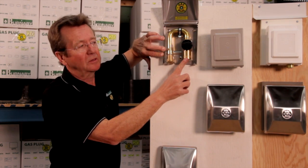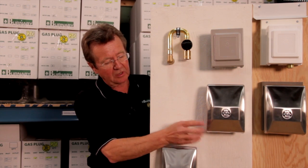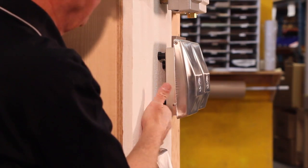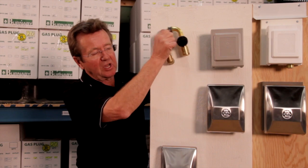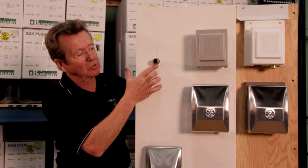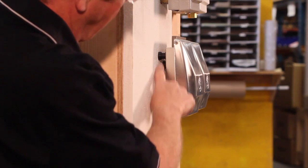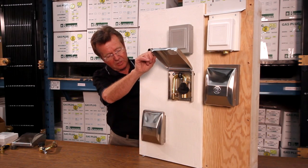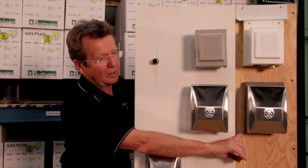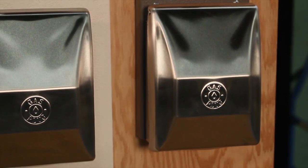Remember not to leave the male plug in the outlet. If you're going to use the adjustable standoffs that come with the stainless steel box, you'll need to allow for that on your nipple. In this case we had five-eighths of an inch out, so if you want to stand it off the wall by three-quarters, you obviously need to add three-quarters to that distance — but you still need the flexibility after you get to that distance. Here we have a shot with the standoffs using the same installation with the three-quarter standoffs, and here is one for siding installations with a backing block on the finished surface.